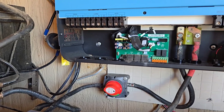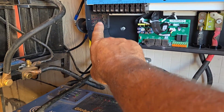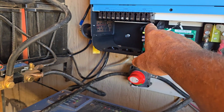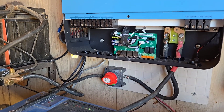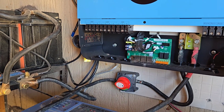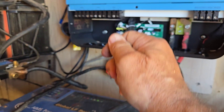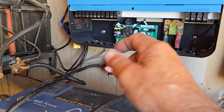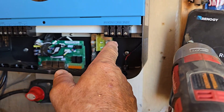Before I even brought it in here, I laid it down on that shelf right there with the top facing up so I could see inside each one. Then I got my number one Phillips and backed out all of the screws so all of the openings at the bottom — which should handle up to a six gauge wire — are fully open. So I won't be blindly poking a wire up in there; I should be able to just put the wire in and shoot the screw down.